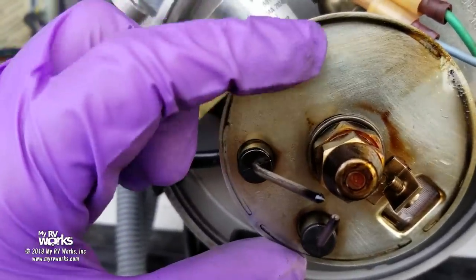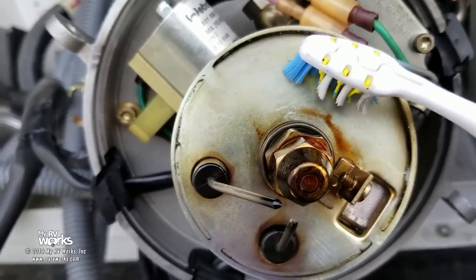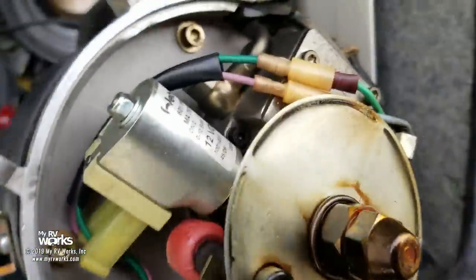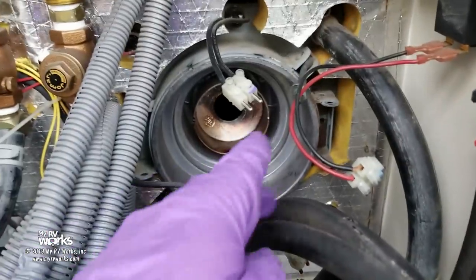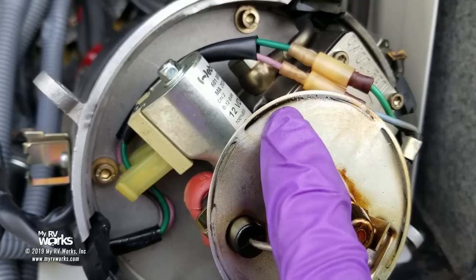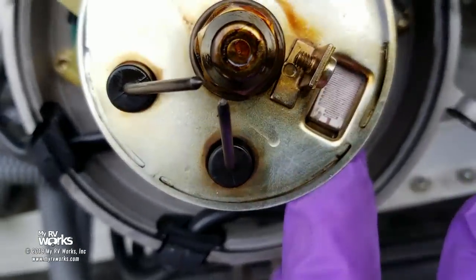You want this to be a reflective plate. If you scrape it too hard or use aggressive chemicals, you'll scrub off the reflective material. The plate also needs to be perfectly flat — inside when this burner starts, it's going to make a seal with the mating part. We do want this plate to move a little bit, and you can see this dark edge where it's been making the seal. This is the nozzle we're going to be replacing — it looks a little nasty, that might be our whole problem. Over here we have a photo sensor that tells the controller there is a flame.